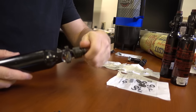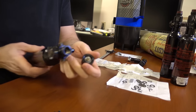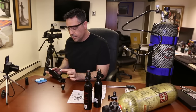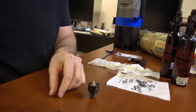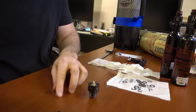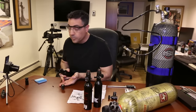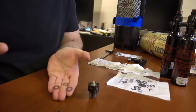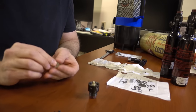Now it's very loose so back it out, take the grub screws off by hand. Unscrew by hand. This one's already been adjusted. There are shims inside — two 0.01 shims. Inside the bottle were three shims: the red one which is the 0.02 shim and two 0.01 shims, for a total of 0.04 shimming. It doesn't matter what order you put them in — it just creates a thickness, which you can verify with a caliper.